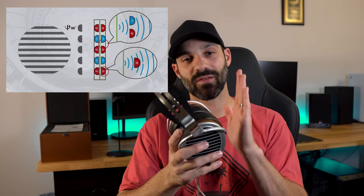There are four general categories of sound production technologies for headphones. You have your traditional dynamic driver — a 50-millimeter driver, for example, with a traditional magnet and voice coil that moves forward and back. You have planar magnetics, which use a diaphragm suspended between magnets in very close proximity, with the goal of having full control over the diaphragm to produce sound accurately. Then you have electrostatic headphones like Stax, which require special amplifiers because they're electrically charged. And then there are ribbon headphones, another cool technology. The majority of mainstream headphones are dynamic driver or planar magnetic, and I love planar magnetics because they're very versatile.